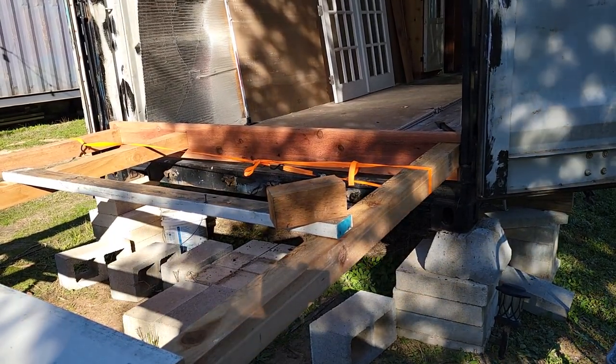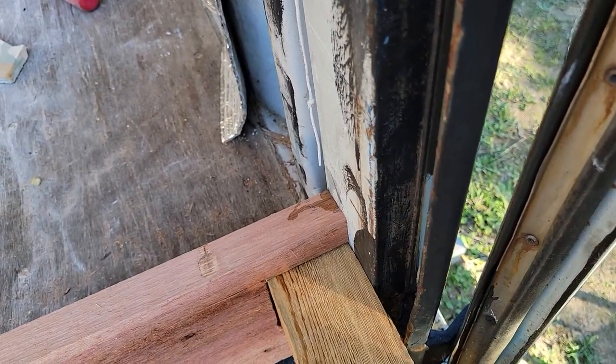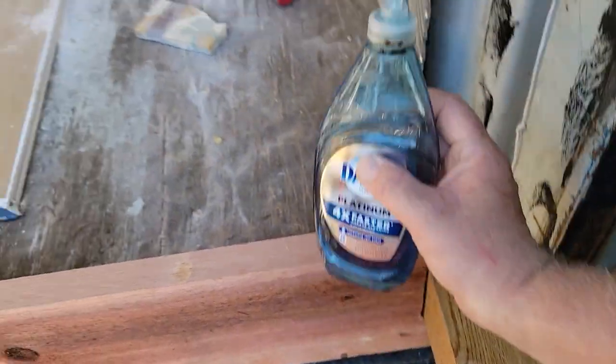That board fit, but I'm wondering if the heat of the day made the dimensions expand. If you've been watching my channel, you know there's an old secret I use — it's called dish soap. When things are super snug like that, I'll get some dish soap and put it along the edge, and that'll let it slide in without splintering the cedar. I don't want to break that cedar floor plate. A little Dawn to the rescue. Look how tight that is — but I like it tight. I just don't want to break anything.